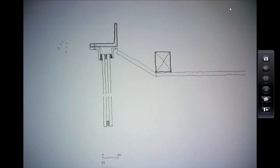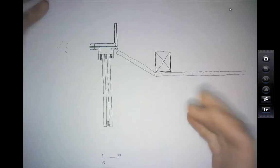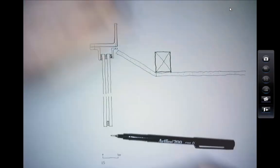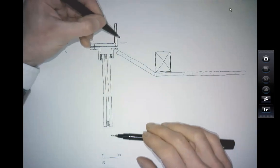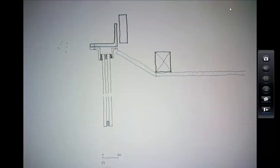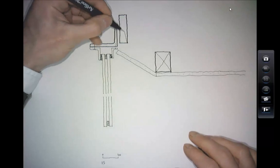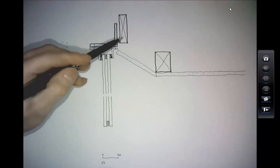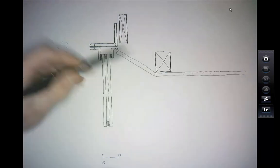What I like about the detailing of this building is it's all just bits put together — lots of bits of angle bolted together, which is kind of what it is. The steel angle isn't fixed to anything yet, so there's another timber member here. I'm using a crosshatch symbol to indicate it's sawn timber. If you're using hardwood you'd put a wood grain effect, but all of this could just be constructional joinery cut to shape on site.